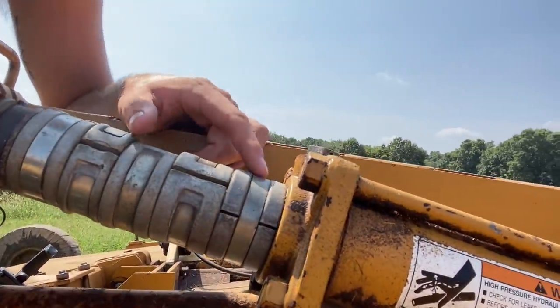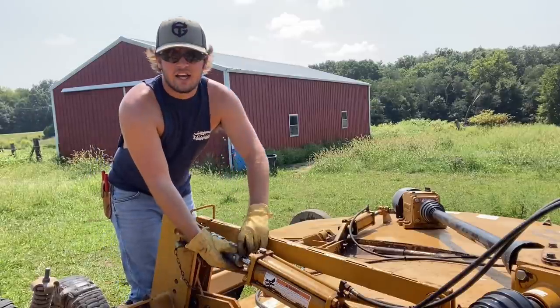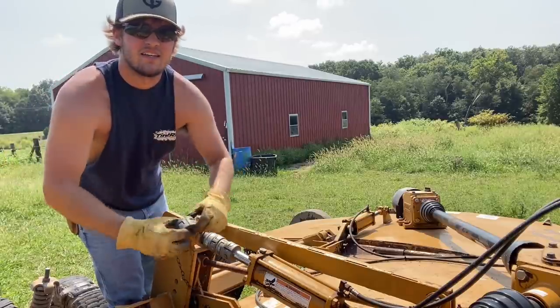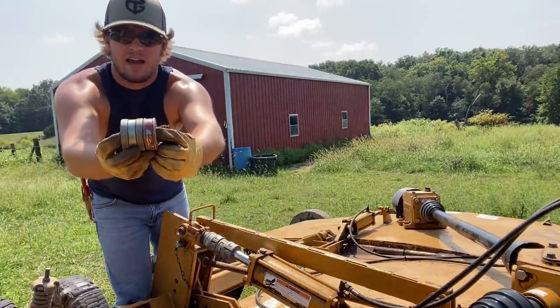That's hotter than a hoochie coochie out here today boys. I think it might be set just right — I haven't mowed with it yet — but I got the level of the bush hog height and it looks a little high. So I kind of think I want to take out a ring. These are your rings on your lift cylinder. I want to take out one of these and put a half-inch one in. They got little rubber or metal bands on the inside, they just open and close. So you take an inch one out, put a half-inch in.